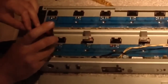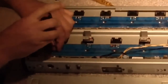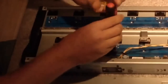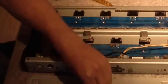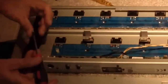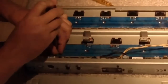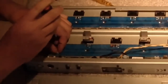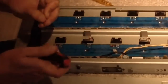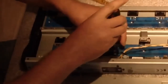Next, the main board. Here I am almost removing the wrong screw, so these are the two other screws which need to be removed first. We will install two special plastic spacers on those two locations, as you will see in a minute. Again, don't lose the screws, because we re-use them. And we don't tighten this screw for now, because we will first try out the position of the new board, in order to have the two spacers positioned correctly.